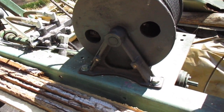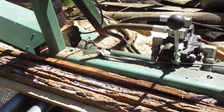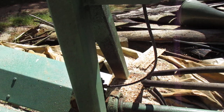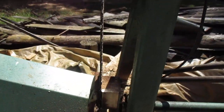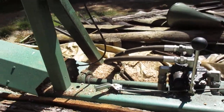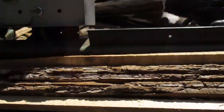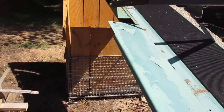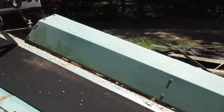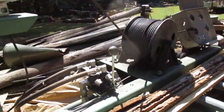You can see the pulley back here is starting to turn now. I'll turn the drip oiler on. Running a little bit faster than it needs to be but it doesn't matter. There's the chain. Then they just go up here and drop into the bucket. The idle's running a little fast so the chain isn't disengaging - when I have it just right it'll disengage.